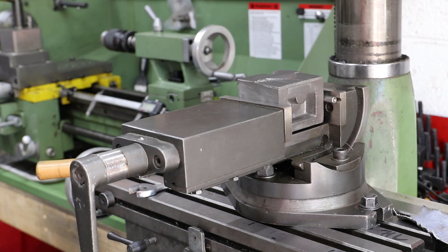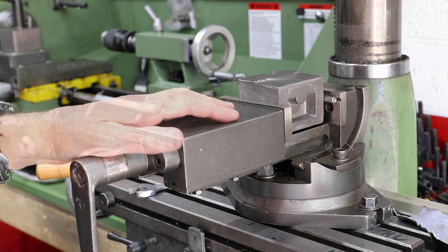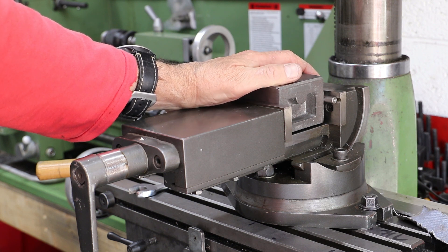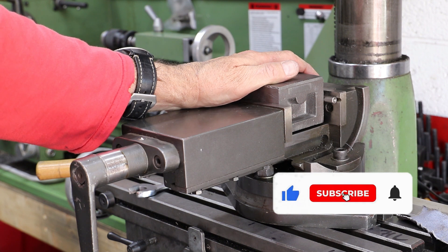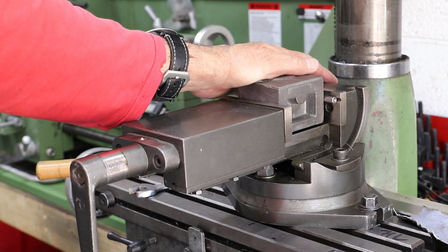Before I can start the boring I do need to get a reference surface, and for that I'm going to use the top of the cylinder — what will effectively be the steam chest. As we can see here I've got the block mounted in my vise in the milling machine. I have set the vise horizontal front to back and also aligned the jaws to the x axis. I would normally use the rear jaw as a reference face but I really struggle to get the cylinder aligned correctly, so instead I use the front. You can see I've got a bit of bar against the back jaw to ensure that the two faces aren't fighting each other.